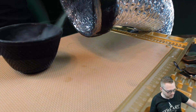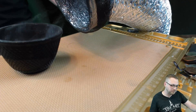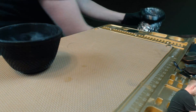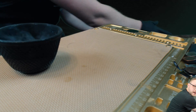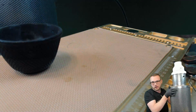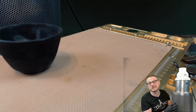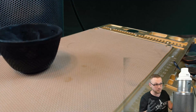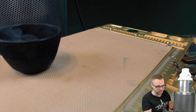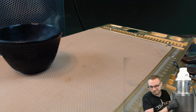It's a pretty simple build. The little carbon filter is going to do great for this kind of work — you're not going to need anything crazy. One thing to note: if you have a multi-station setup with more than one person working, instead of buying two of these, you could get the big unit with the eight-inch fan and giant eight-inch carbon filter. It's got enough power to run two or three hoses. That said, it's overkill if you're just running one four-inch duct line — you'll get a lot of backflow. But for multiple people, it's the key.